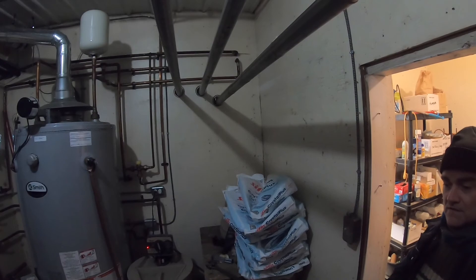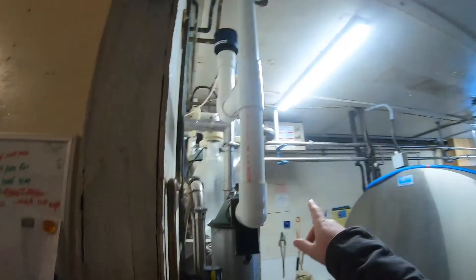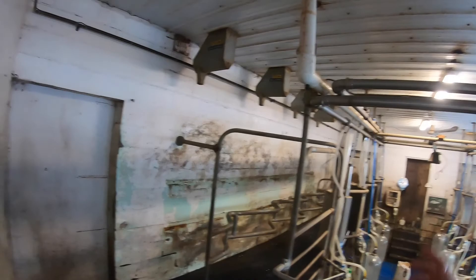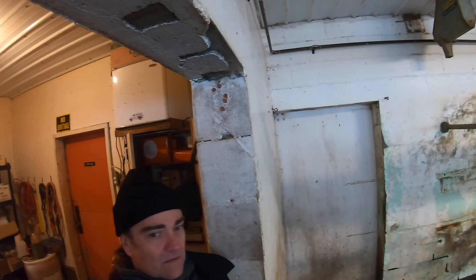We upgraded from electric to gas. It was a big electrical boiler — 100 amps — so it took a heck of a lot of energy. This is a variable drive unit. We've got a 20-horsepower pump; it'll start slowly and then wind up to speed. That's running right now. There's another one in the parlor in the corner here because we upgraded from that electrical one. See that little small electrical one there? In the middle? That didn't really do much. Now that one's kicked in — it's warm in here, you can actually milk in a t-shirt. And to run those things is super cheap — gas heat is inexpensive.